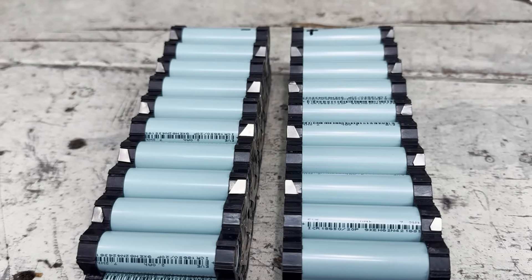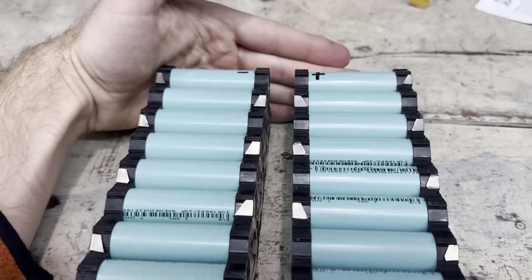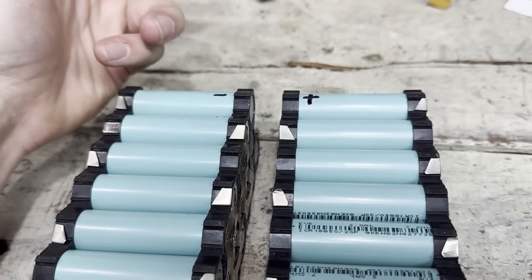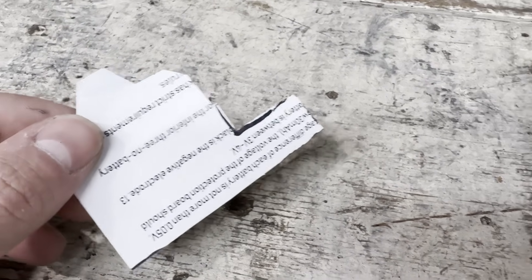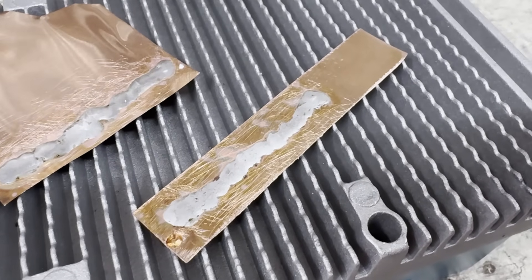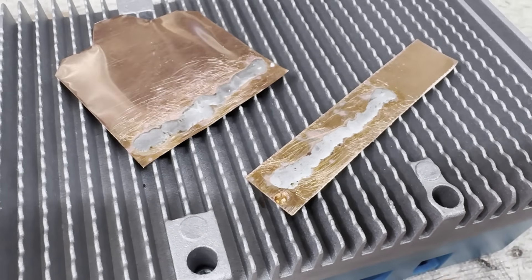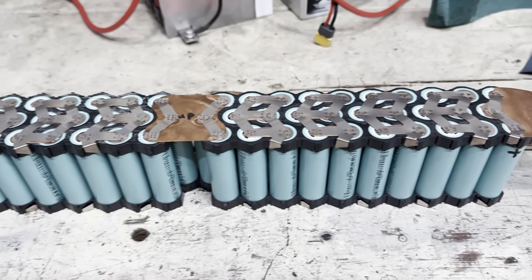Since this new BMS is going to be thicker than the old one, I don't think I can put it on the top anymore, so I'm going to put it on the end. I think I can probably put a copper sheet that goes directly to the BMS. For that piece of copper, I started with a paper template, then used some 0.1mm copper and some 0.5mm super-thick copper for the main current-carrying part, and I'm just going to solder them together. Finally, I'm done spot welding — now it's time to fold the battery.